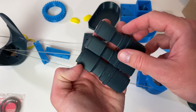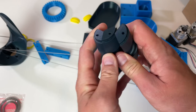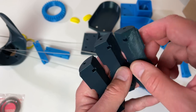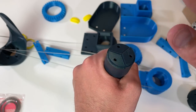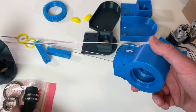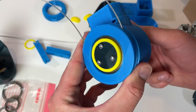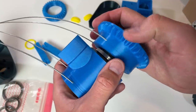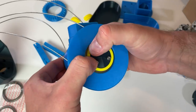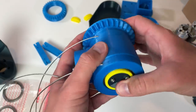We need these three pieces for the axis. I'm really happy with this design because the layers are in the direction of the axis, so these three pieces make a perfect cylindrical axis. Before assembling, we need to put the nuts into the holes so we can screw something in afterwards. For the axis we need 6707 bearings. The pulleys go on the axis with bearings and spacers on each side. The fit is quite tight so you need to apply some force. The axis runs quite smoothly — I'm really happy with this so far.